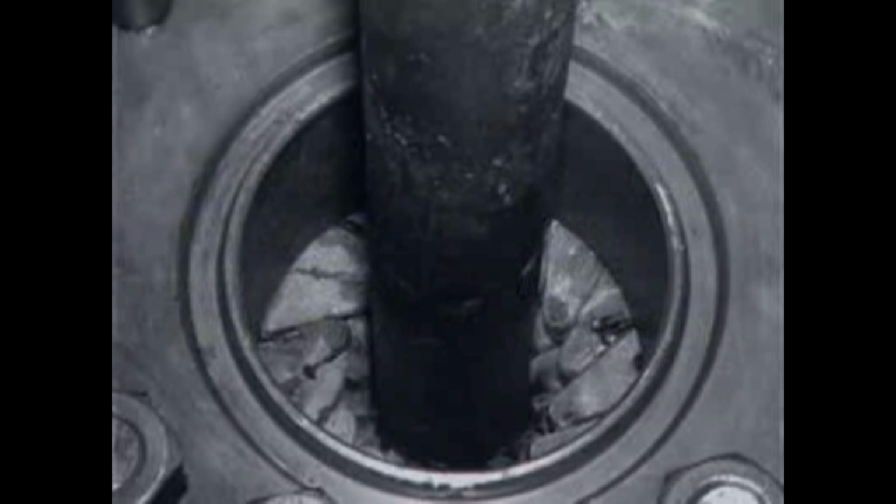For the Cameron D preventer, this approximate closing pressure can be arrived at by using the formula P, which is stripping pressure, equals 0.25 times the well pressure plus 500 psi. An example would be, if your well pressure is 1,500 psi, then P, which represents stripping pressure, equals 0.25 times 1,500 plus 500, which equals 875 psi.